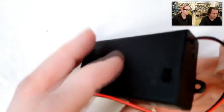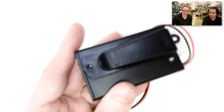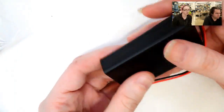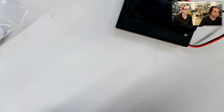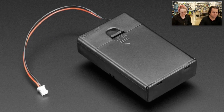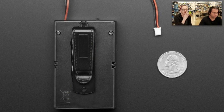Not everyone wants a lithium-ion battery with the charging and dealing. There's a belt clip glued on the back, so you can clip it onto whatever you like — your backpack or your belt or whatever. This one has a little screw that holds it closed. It holds three AAA batteries. We also have another version: the AA version. If you want a AA version, it has an easier opening front, also has a JST connector, so it works with Flora, a Circuit Playground — pretty much everything that doesn't have a Li-Poly charger. You can power it up with this.